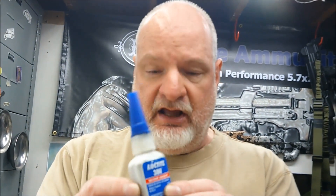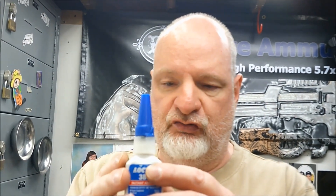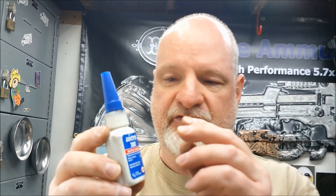For the insert, after you drill the hole, I recommend putting some adhesive in there. The one I use the most is Loctite 380. It's expensive and most people haven't heard of it. The issue with most crazy glues or heavy-duty adhesives is they don't have shear strength — especially on metal or certain polymers, they shear off. Loctite 380 has super glue in it but with rubber particles mixed in, so it has much higher shear strength and much better resistance to vibration.